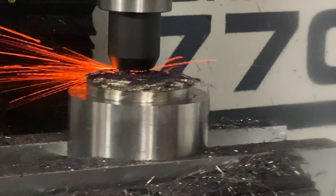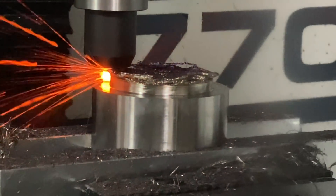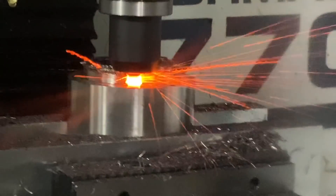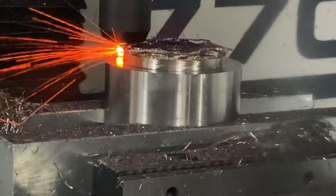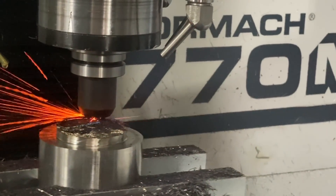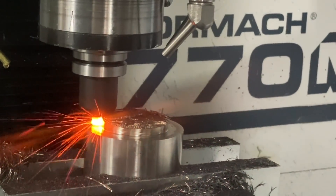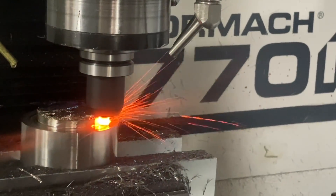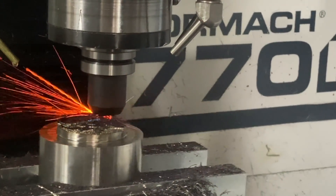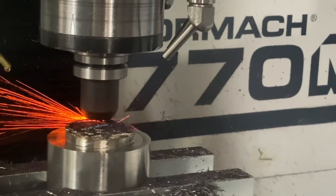With carbide, it comes into the Inconel and creates heat. The faster you go, the more heat that comes up, and there is a limit to how much heat you can put into that partnership — the tool and the material. Once you go up to a certain level, instead of increasing productivity and efficiency, you decrease it. You wear your tool and eventually break it, wasting money. So carbide machining and ceramic machining are completely different.